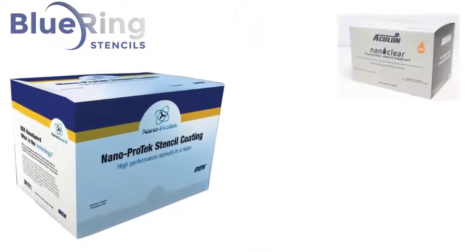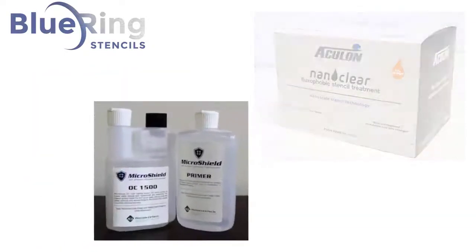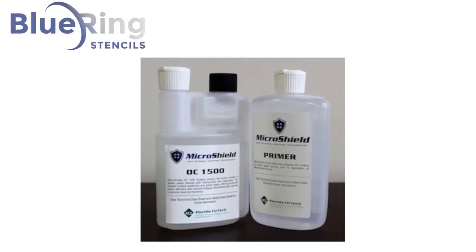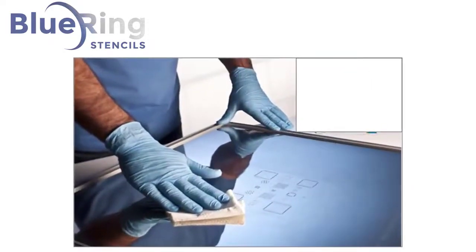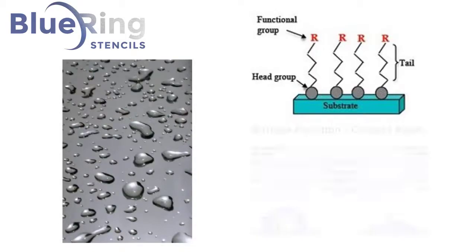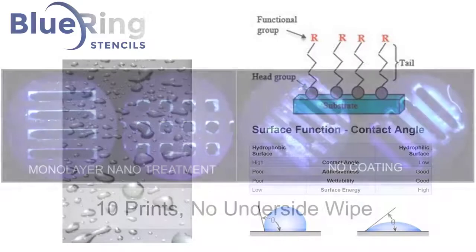In 2011, nano treatments for SMT stencils were introduced. They were manually applied by first cleaning the stencil surface with a cleaner and primer, and then wiping on the monolayer treatment which bonded to the stainless steel surface. The result was a hydrophobic or water repelling and oleophobic or oil repelling surface on the bottom of the stencil.